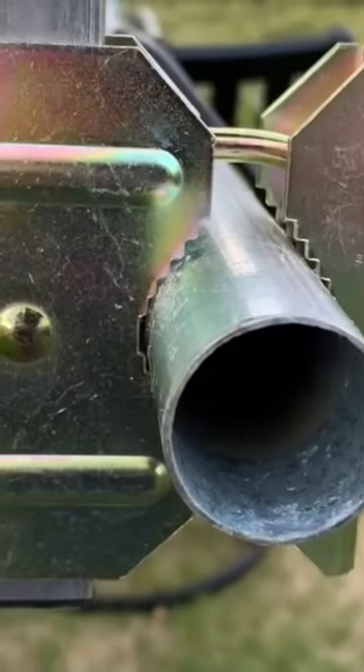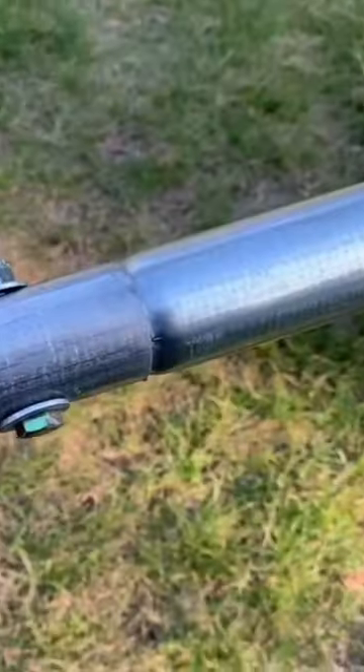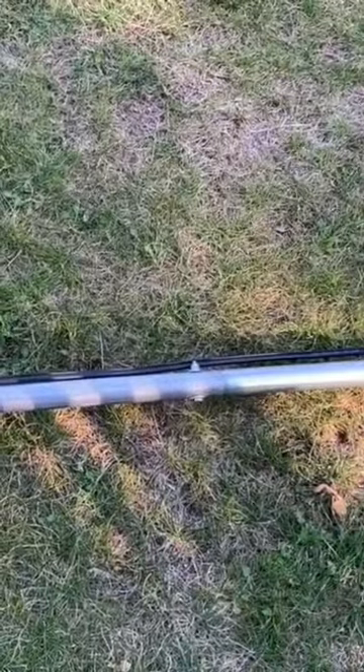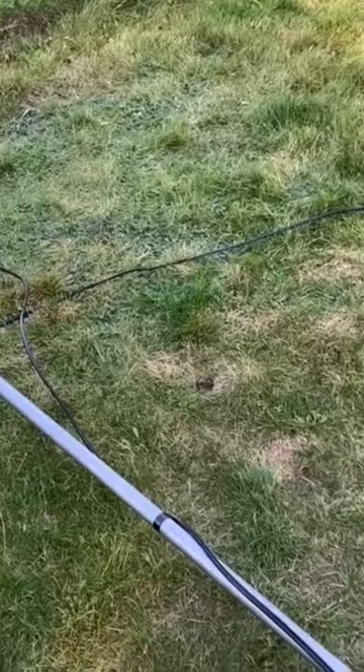It pretty much fits every single mast clamp I've ever seen installed on a TV antenna. If you're going to be joining two or more sections of this pipe like I have here, and your mast is going to be taller than 10 feet, then you want to use proper bracing. The vertical load of a really long mast that has to overcome gravity, wind forces, and the weight of the antenna could easily break under the right conditions, and that's why guy wires and proper bracing is required.